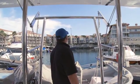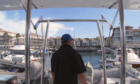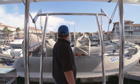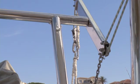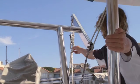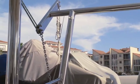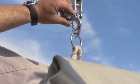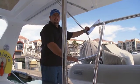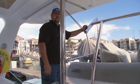Ready to go up, Jakob? Yes, you can go up. Stop. The next step now will be to clip in the clips from the rope hanging on top into the bridle from the dinghy. What we're going to do now is take the supports out and clip it in place, then slowly drop the boat forward — the whole davit system should move forward and drop the rubber duck into the water.